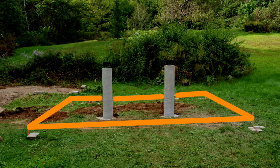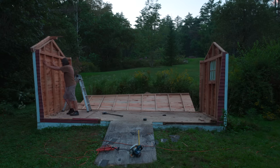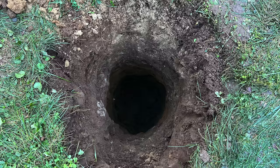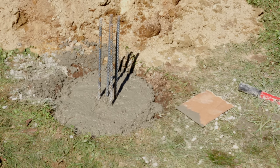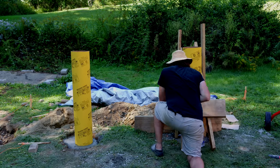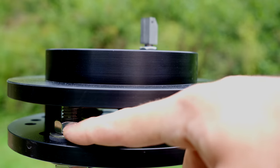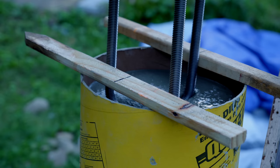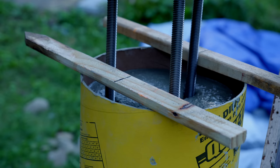For anyone who didn't see part one, I'll link it in the video description. As a recap: in that video I covered how I picked the location in my yard, showed demolishing an old shed that was in the way, staking out the footprint of the building, and finally digging and making the telescope piers, which I made out of poured concrete into sonotubes — just cardboard tubes. Then I pushed metal pier plates attached to J-bolts into the wet concrete at the top to finish those off.